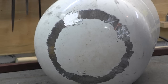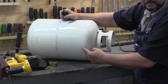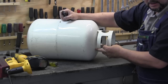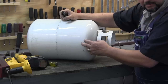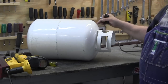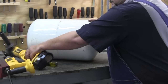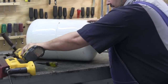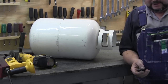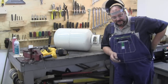What I'm going to do next is score a line around the top of this where I'm going to cut the top off. I'm not going to be using this top like I did in my Freon bottle rocket stove videos — I have a piece of plate steel for the top, so this can be discarded. I'm going to score a line all the way around and cut it off. I believe I can cut it with my jigsaw, but if it's too thick I'll use my cut-off wheel because I need a really smooth cut — a cutting torch would leave too much slag. I'm saving up for a plasma cutter; Tractor Supply has one for $800 and that'll open up a whole new world of clean cuts.